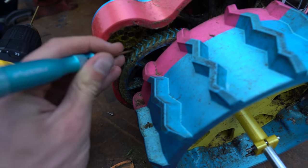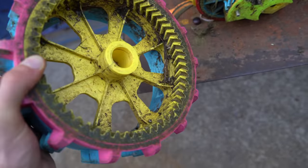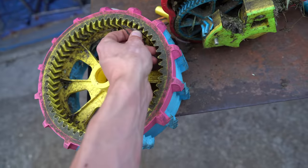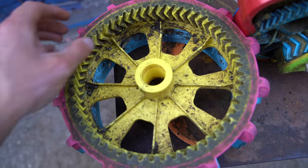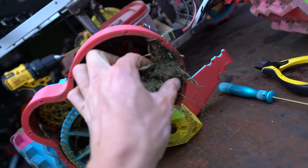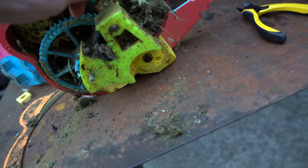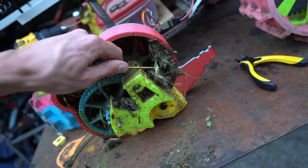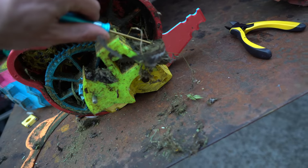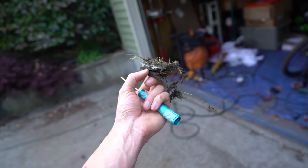On the inside it's just caked — that's disgusting. There's probably so many slug guts in that. Look at this — this is like compost. There's mycelium growing on it. I'm growing mushrooms in my rover! The gears definitely don't look straight, which could very well be why they bound up. I think I just made cow poop — this stuff literally smells like cow poop. It's just chewed up grass. I figured out why it seized up: this yellow gear right here welded itself or fused itself to the red surface behind it. It just got hot, filled up with grass, and then they started rubbing and fused.